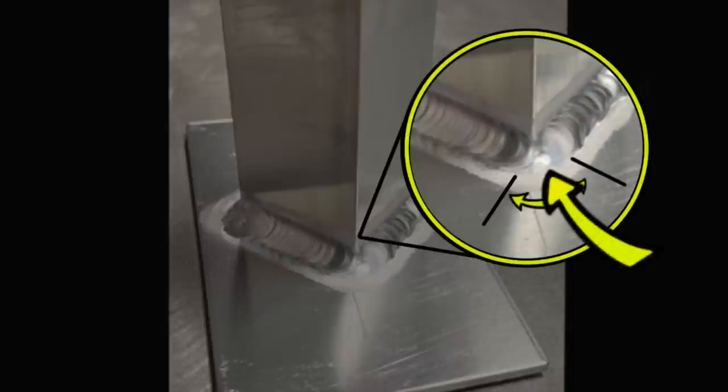Because of this improper connection, we have a gap or a void in between the two passes right here. Whether this is aluminum, mild steel, stainless steel, or whatever — it honestly doesn't matter what it's made of. This is a welding flaw that can cause big problems down the line if not taken care of at this point.